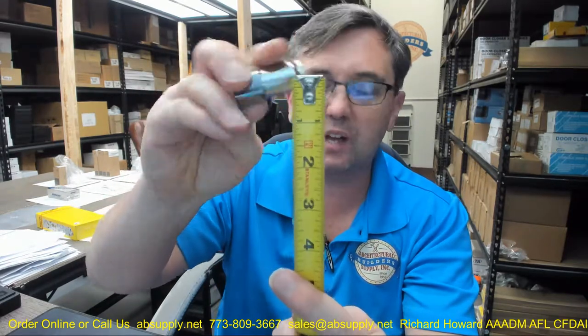Screen down below: overall length is about an inch and three quarters. Diameter of the body itself looks like it is about three quarter inch, just shy — 11 sixteenths. Width across the flats about 13 sixteenths, that will be the blow-off cap.